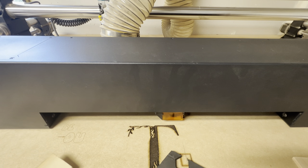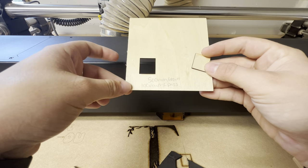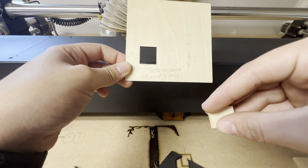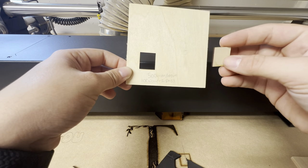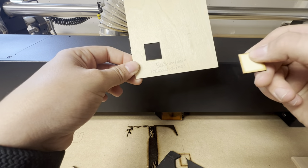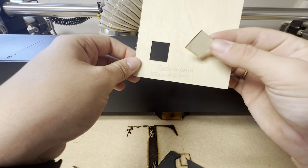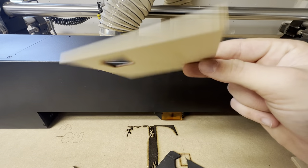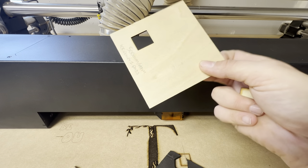I've done a couple of tests. The first one is this normal super thin — about a sixteenth inch — plywood that came with the machine. I cut it super fast at 500 millimeters per second with one pass only. All of these are run at 100 power. I always run everything at 100 power, especially when cutting. And this just cut like butter — super easy. You can make little keychains out of this material or test cards and things like that.